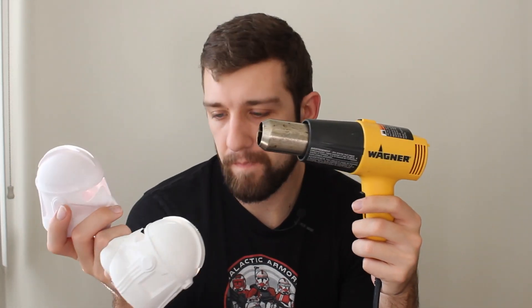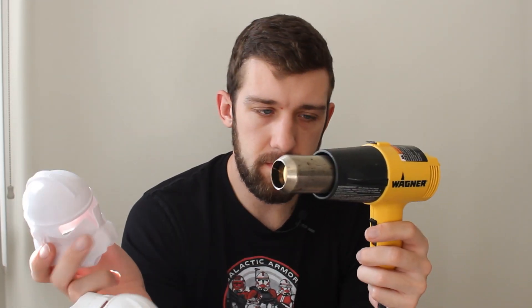This whole video is dedicated to testing the heat tolerance of PLA compared to PETG. I've got this poor little PETG helmet here — the walls are kind of thin because the helmets are scaled down so far, which is why the face broke a little. What we're going to do is blast both helmets with a heat gun — a continuous blast of hot air for about a minute — and then compare the results to see how well PETG stands up to heat compared to PLA.